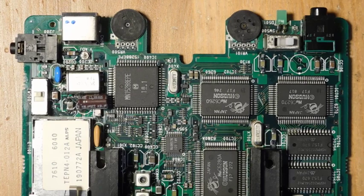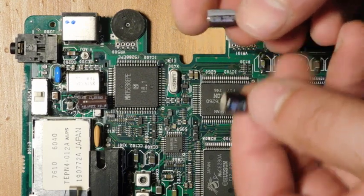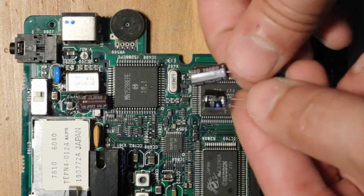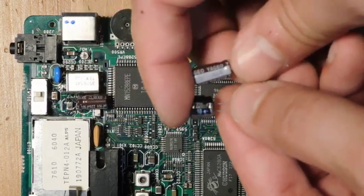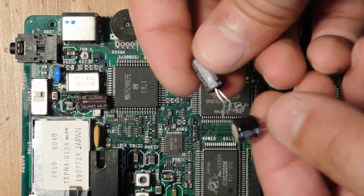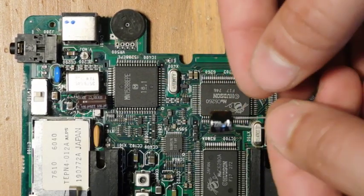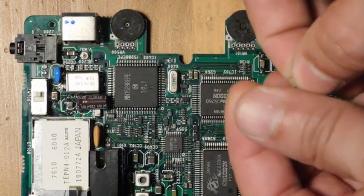There isn't like a capacitor map or anything like that, so I'm going to take my time. Here's a quick example: this is a 220 microfarad capacitor — the original one that was in there, and this is the one I'm replacing it with. You can see that the size is much shorter. This one also has the correct capacitance and voltage for that spot, but because it's smaller, I won't have to contort it into some weird shape to make everything fit. This is a Nichicon capacitor, so it's a high quality manufacturer.